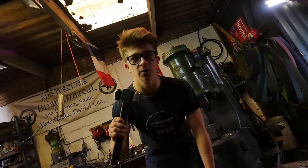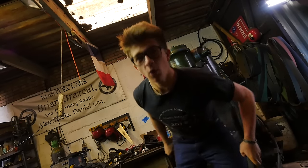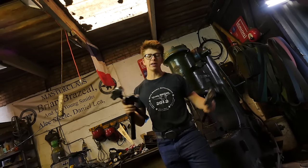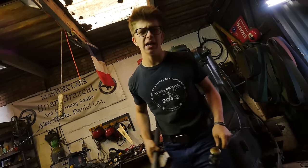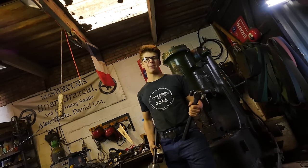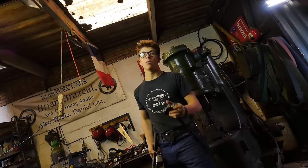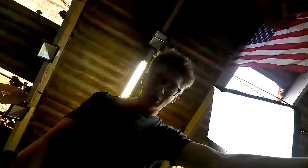You might be wondering which hammers will be available on the website. We're going to have square circles, we're also going to have the classic rounding hammer, and as a special for this pre-order only, we're also going to have the classic cross-peen hammer. That's very much an offshoot from the classic rounding hammer, with a drawn-out peen — which in the lower weights is perfect for the farrier wanting to pull clips on horseshoes, and in the higher weights is perfect for the blacksmith wanting to make wonderful leaves and do extreme lateral draws, such as when you're making a spatula.